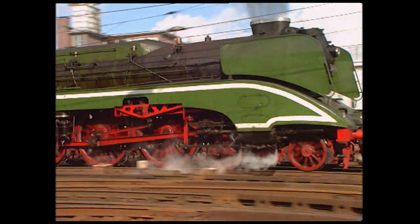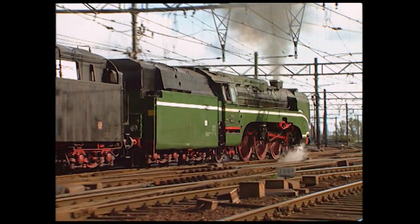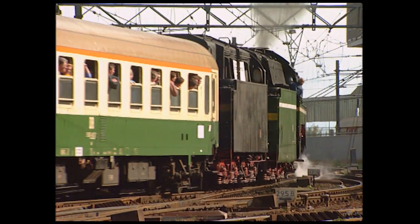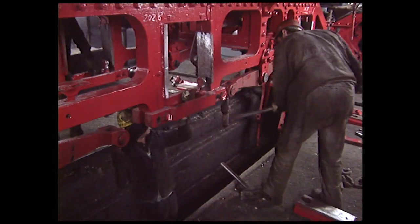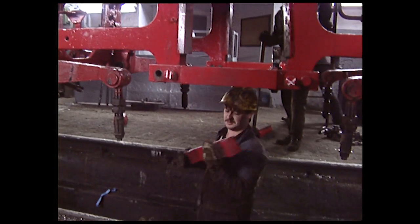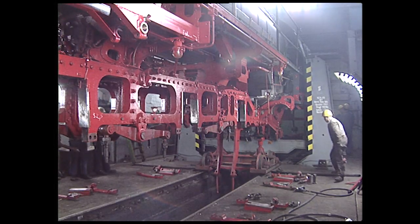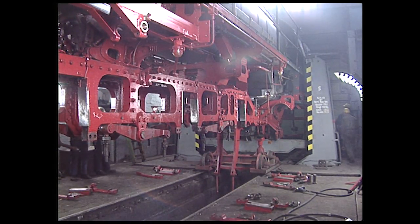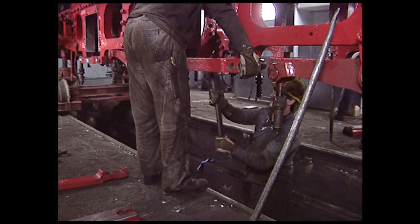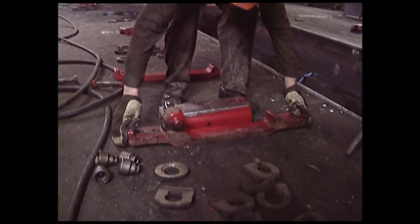The 18-201 has a so-called bar frame. In these horn gaps one side is tilted to accommodate wedges. The wedges eliminate any longitudinal play in the axle boxes. A bar frame is indeed a collection of bars. On the lower edge we see levers, the so-called equalizers. These connect the springs of several axles to spread the effect of bumps.